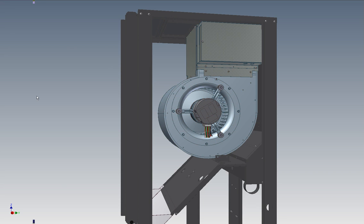This means it spins slower for the same airflow and there's less blower wheel noise. There's an electronically commutated motor, or ECM, in the center here, which maintains a constant airflow regardless of duct size or filter condition, and it's more efficient than a PSC motor especially at part load speeds. This is the latest release of the ECM from GE or Regal Beloit, called the EON motor. There's also an optional plenum heater available in a full range of sizes for either auxiliary or full backup electric heat.